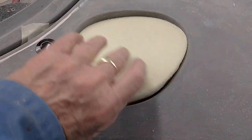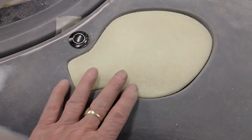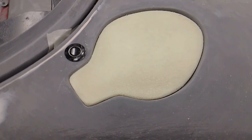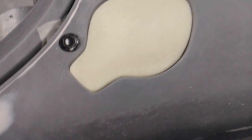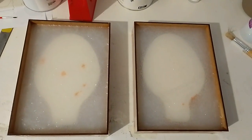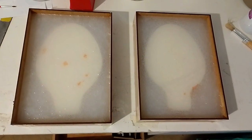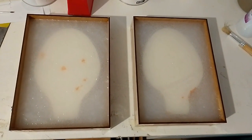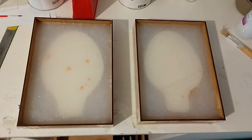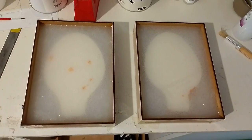And that's it all trimmed. Well, top's trimmed anyway. So that's the sort of fit we hope we're going to end up with. Not sure exactly how I'm going to do the moulding, but we'll sort something out. Right, that's the 2 bucks put in the boxes and the silicone poured on top to make the mould. So once that's done, I'll then pop them out the mould and make up the first fiberglass ones, which will then become either the ones to use, or I may have to use those as a buck to make another mould. We'll see how it works out.